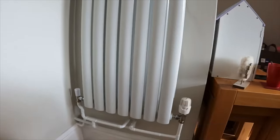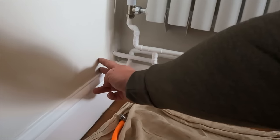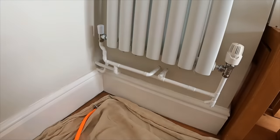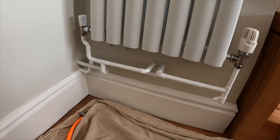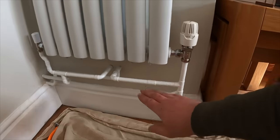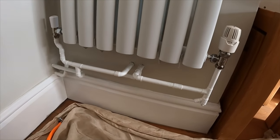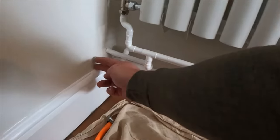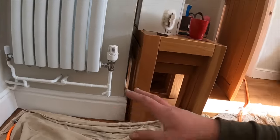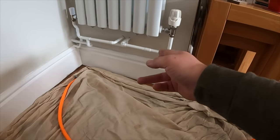We've decided to keep the original rad because the room does get cold quite badly. We're going to mount the new rad on here, come off this pipework, drop down off a tee, drop down off another tee, running on the skirting to feed that rad. There's going to be a fair amount of pipework but without chopping the walls out it's going to be a major job. They're going to either box it in or the sofa pushes right up against it anyway. It's a gravity-fed system so we'll go up into the roof and bung the tanks.